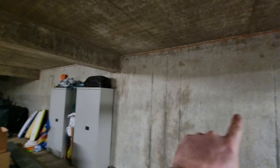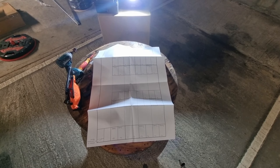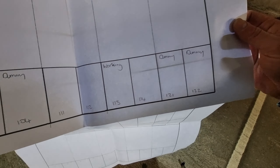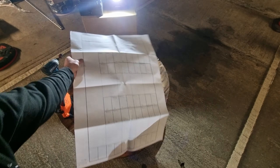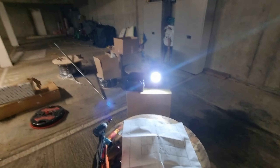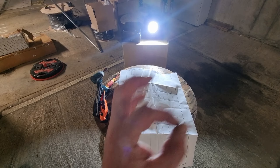Pete's set up cutting some unistrut — we're going to have some tray all along here as our route down to the other end. I've designed the car park layout in A1 and had it printed out. Each bay is numbered and marked whether it's getting a dummy or a working unit. We're going down in circuits, so at each point that's where the whisker boxes will go. I've got my drawing by my side so I know how many boxes each row needs — it should be nice and organized.